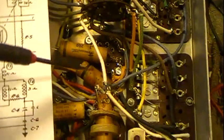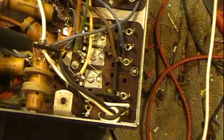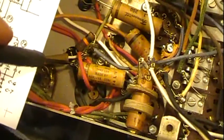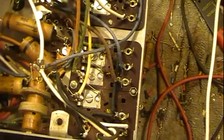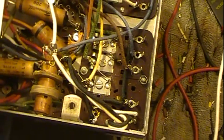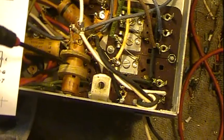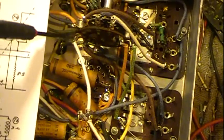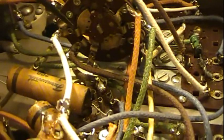So let me stand up here, moving around a lot. Here appears to be a coil. We can look, and here are our antenna leads. We follow them back through the tie. Here's the black lead, which is ground, and it goes down here to a tie point and comes over to a ground connection right here. And that leaves the white wire as being antenna, so we follow it up. It hooks to a coil here, and we could do a little checking and see that it actually hooks to this one here, this big coil, which is about 37 ohms. And we can then follow this wire out, and it hooks here. So what is that? Well, that happens to be hooked right here.